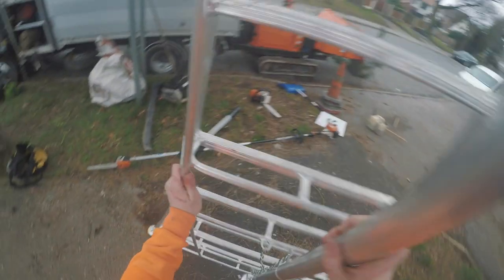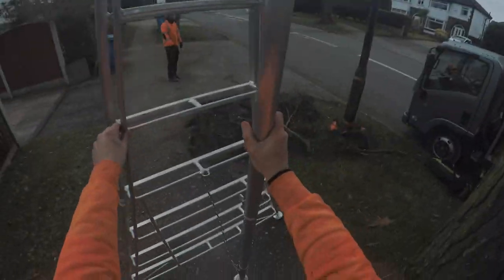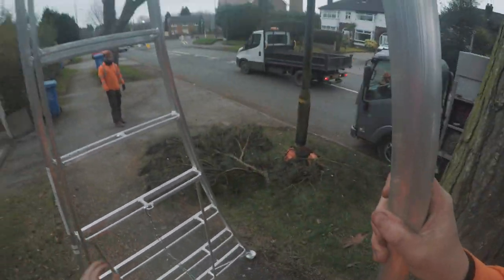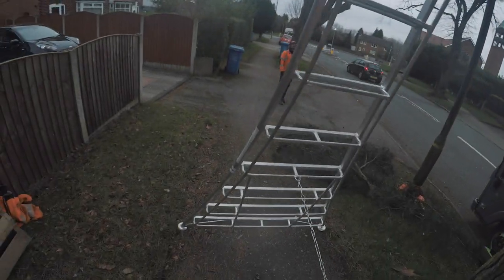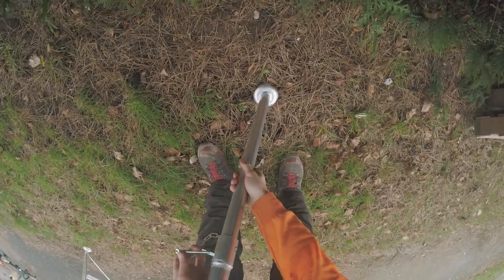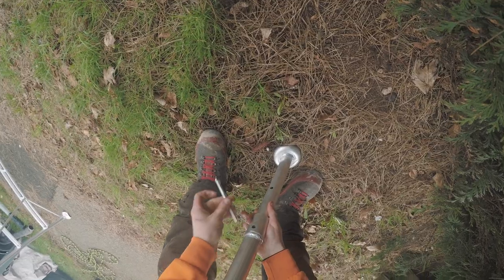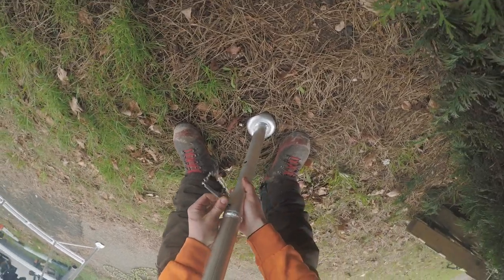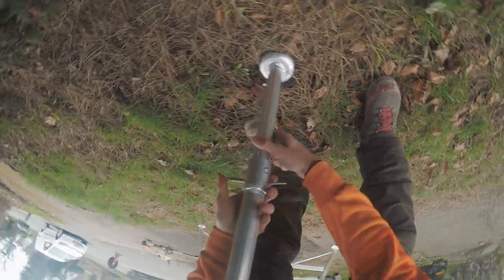These tripod ladders are really strong and sturdy. They're lightweight and easy to use. Because they're so lightweight, they're easy to carry in and out of domestic gardens and tight spaces. They're actually quite easy to set up and move. The ladder that I'm using has one adjustable leg — being the standard model, it's the 12 foot one. This is great for if you're working near steps or an uneven surface where you can get two legs on flat ground, and the third leg you can adjust to have it on a different level to make a stable, level platform.